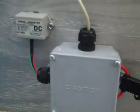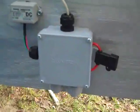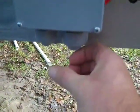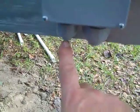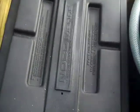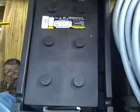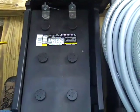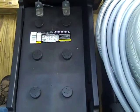There's the Flex Charge controller and surge arrestor. I'll pull this box off and show you — wires from the solar are coming up, I'm bringing conduit in here, and going back out with the battery sensing wires. The batteries here are the Deka 8A8Ds — 245 amp-hour batteries — wired in series to make a 24-volt battery bank.